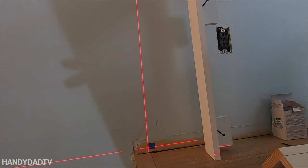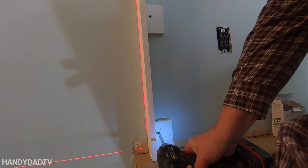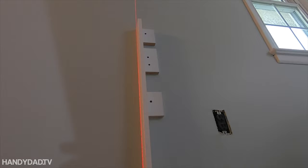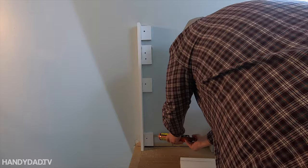The first post I installed was actually the partial post against the wall. I thought there was going to be a stud going straight up the wall, but there wasn't — the framers just put cross pieces. So I had to put another block right where the original railing was attached to the wall, and that's how I hit the framing at the top. That board on the wall is the only one that was ripped — not a full-width 1x4 — so I had to take it home and use my table saw. All the other boards are full 1x4s or 1x6s.